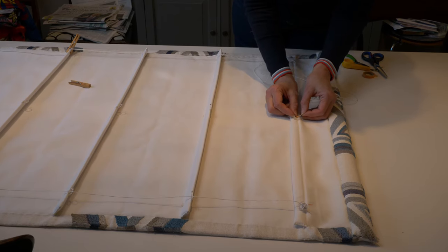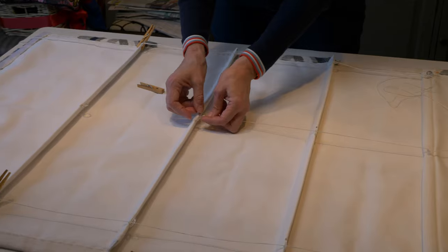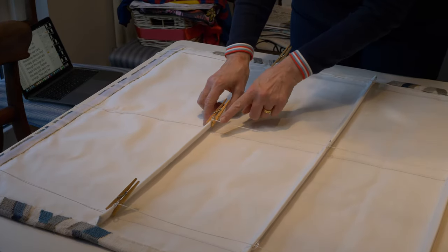There are legal requirements to help reduce the risk of strangulation accidents and I've added a link in the description below, so please have a look at this — and of course it's probably different in each country so double check the regulations in your country. Now the toggle's on, we're going to thread the cords onto the blind starting at the bottom, threading it through the rear cord breakaway device. Then carry on going vertically through all the rings till I get to the top of the blind.